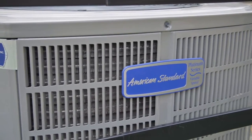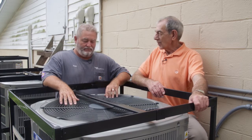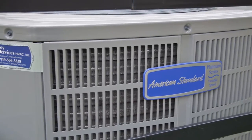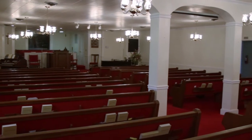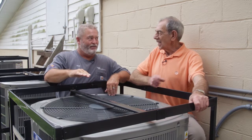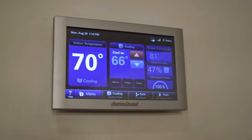We just ran inside and turned the thermostat down to 67 degrees — I want this thing running at 100%. Is it getting faster? It's getting much faster, a little louder, but not the noise you'd expect by speeding up like it is. We've done something here — something is different. This unit is cranking up to 100%, changing speeds all the time. A bunch of people show up to church, doors open, kids running around — temperature rises, and the unit starts changing speed. The American Standard 20 SEER variable goes to 100% capacity, then ramps down as it gets closer to temperature. But it doesn't shut off — it just ramps down.